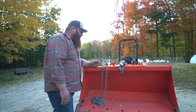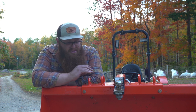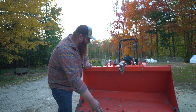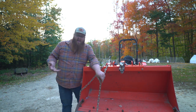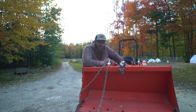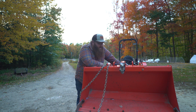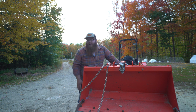Where I see using these hooks for me is in firewood processing. I'm not ready to start cutting right now, but what I envision is moseying up to the center of a log, hooking into this ring with a chain hook, going around the back of the bucket, coming back up and chaining that log so I can lift it and buck it up into 16-inch lengths to split and put in the wood stove. Kind of like a poor man's grapple — obviously a little slower since I'd have to feed the chain through rather than just driving into the log and grabbing it with the hydraulics. But this is going to be one-tenth the price of a capable grapple for the front of my BX, and that's not counting third-function hydraulics and all that other stuff. This is literally just an hour of your time to install.